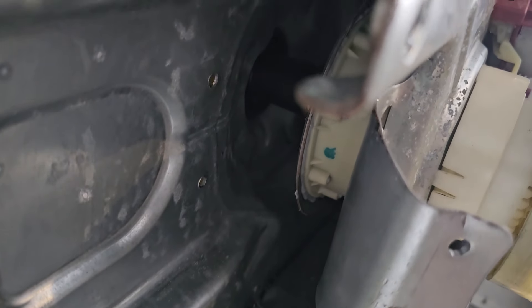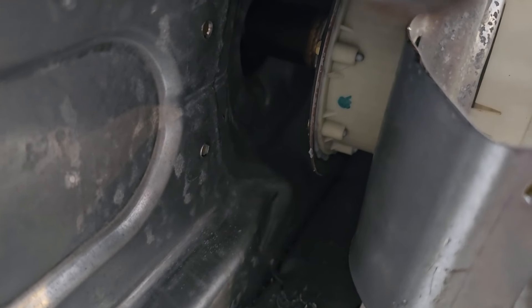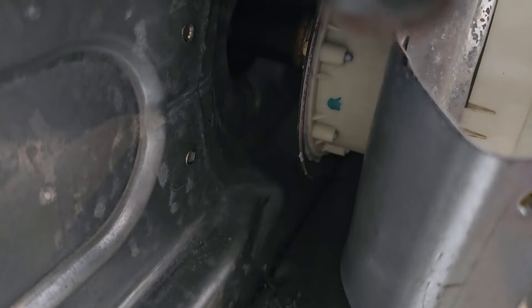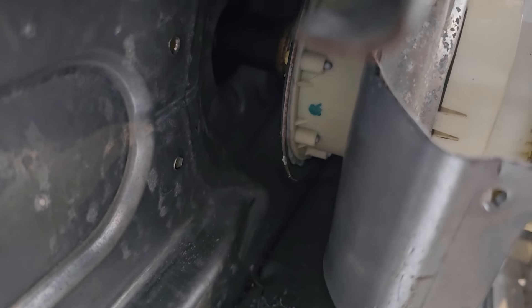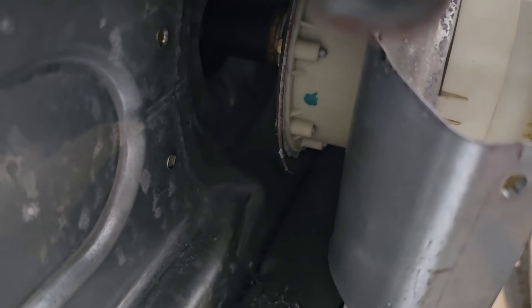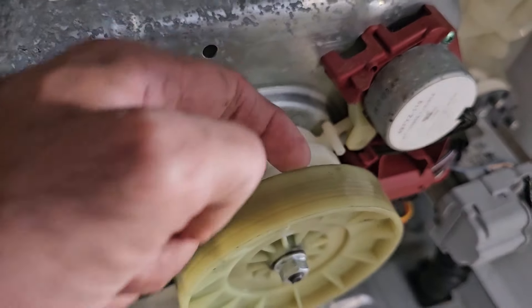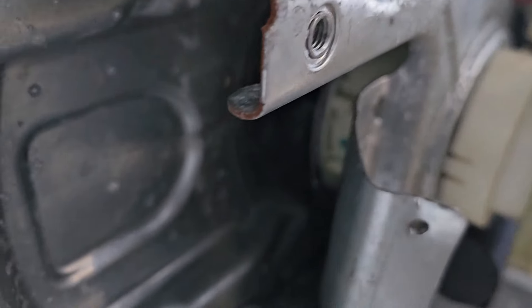The size of the hole really doesn't matter — it just matters what sort of fitting you have for your grease gun. We're going to drill the hole, drain out whatever remaining oil is in the well, and fill it up with thick white lithium grease, or any sort of white lithium grease. This white lithium grease is very thick and it won't leak through the nylon washer that holds in that oil or grease.